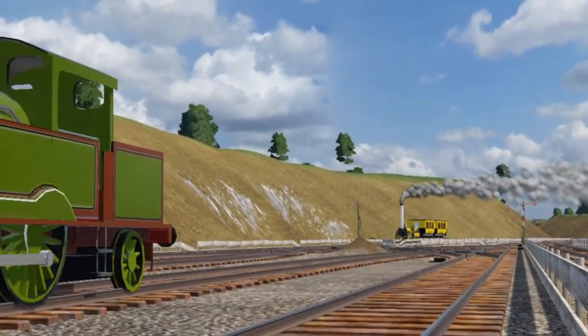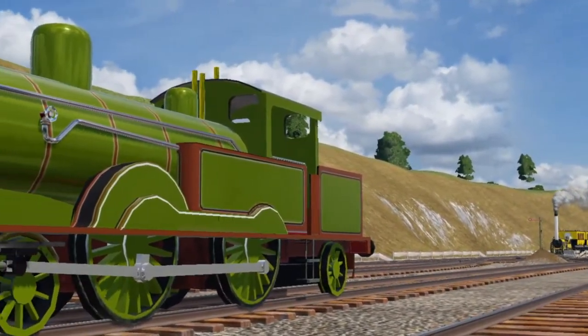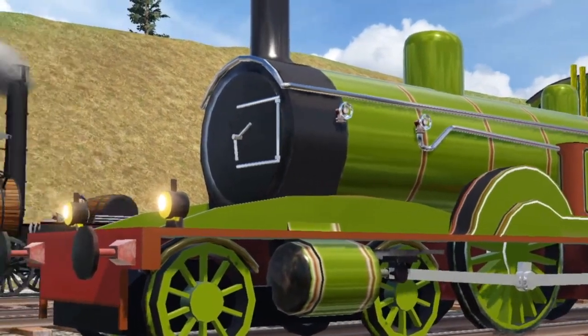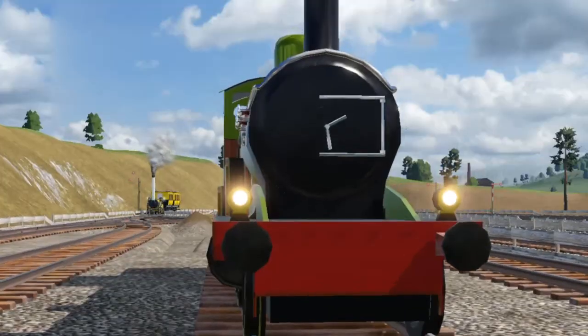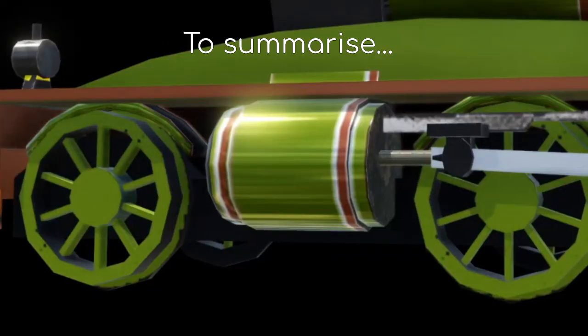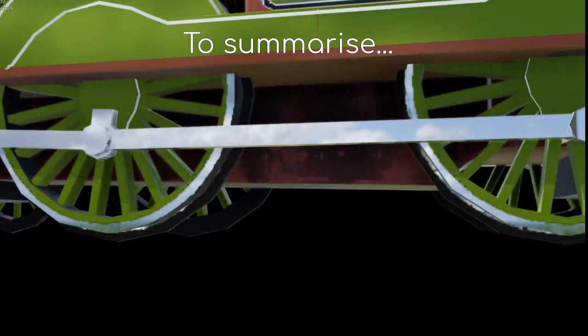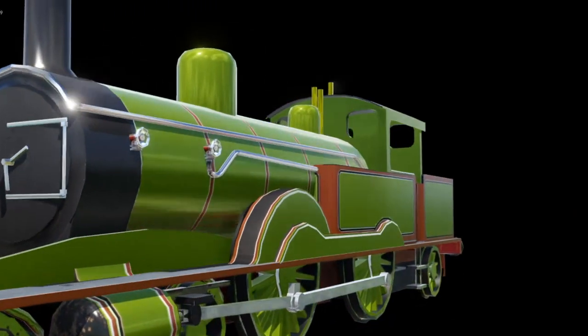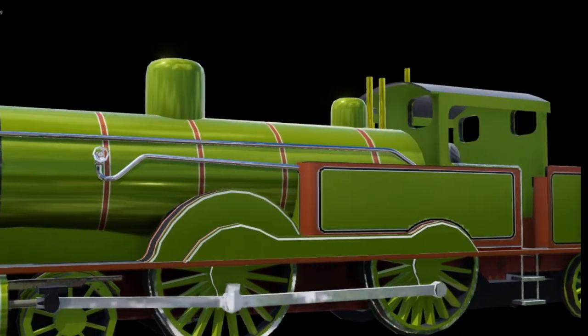And as we advance on, we get to the engine we're looking at here: the Adams Radial Tank, London Southwestern Railway 4-4-2T, Class 415. This engine is special in that it uses radial technology, but I won't cover that in this video — go watch Chris Eden Green's video for that. So we've got four front wheels that guide the engine around corners, four driving wheels providing the tractive power to move the coaches, and rear wheels keeping the bunker in check. These rear ones are pivoted — these are the radial wheels — and they do some fancy turning which stops the engine from binding on curves.